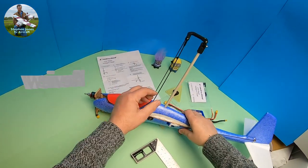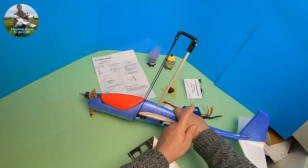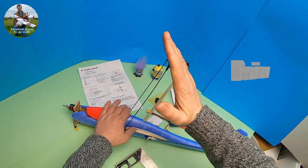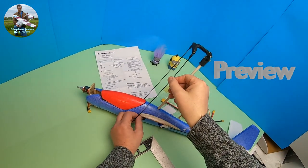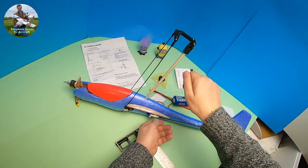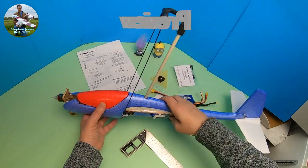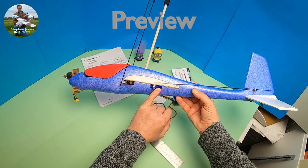The reason why we have metal rods at the front and not at the back is because the blades are angled back — so the constant force is pulling back — and it's better that tension is being applied to these rods rather than compression, as compression would cause them to bend. That's the reason why the metal rods are positioned there at the front.